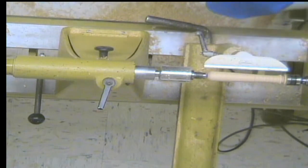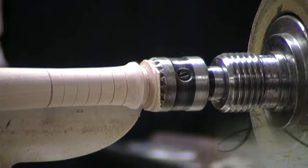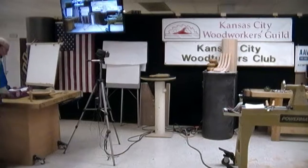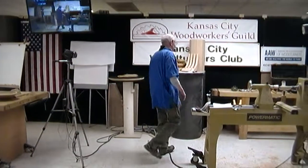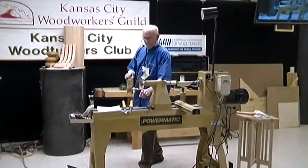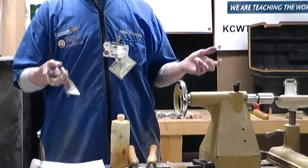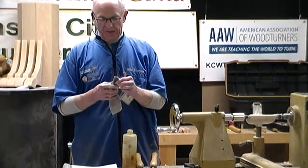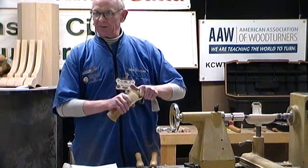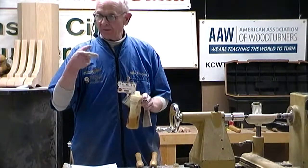That's good. What Sean Graham uses is walnut oil and beeswax. It takes just a little bit. This is why you can finish it and it dries right here. Some people say don't ever use cloth on the lathe. Well, this doesn't shred like paper towel does, and I don't wrap my fingers around it. I do other things with my fingers.